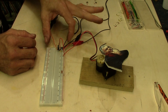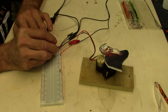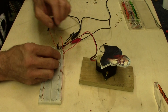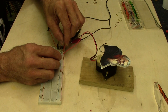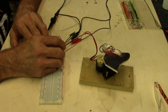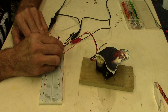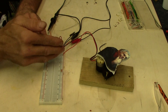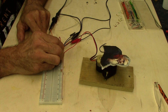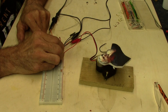Here's my power coming in, and this is my gate that I can trigger by applying voltage to it. The motor is on or the motor is off. At full voltage the motor spins at full speed. But if I want to go slower, I can modulate it by touching and letting go. Depending on how long I stay on and let go, the time duration of my pulses will affect the speed of the motor. So I can go slow, or a little faster, or wide open.